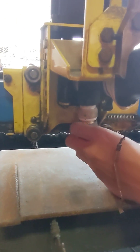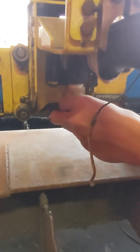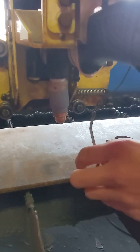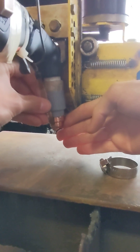You then carefully unscrew the tip that's currently in there and install the tip of your choice. You then take the material contact wire and place it so that there's metal-on-metal contact, but it's not so low that the material contact wire actually touches the metal itself — so the tip is still longer than the wire.